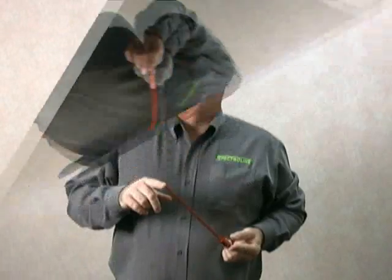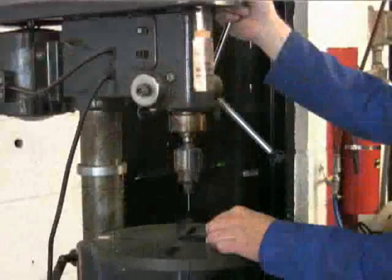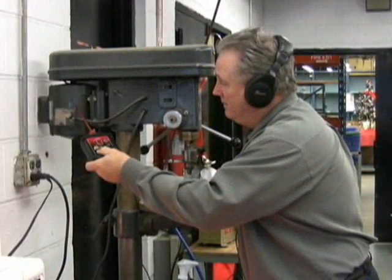At the top of the receiver is the nose piece. This is where the Marksman gathers ultrasonic sound. The nose piece also serves as a holding fixture for the air and contact probes. The air probe is hollow and nothing more than an extension of the nose piece — it's used when you're looking to isolate a problem among several suspect areas. The contact probe is solid and is used to check parts like gears and bearings that are enclosed in some type of metal case or housing. Sound waves travel great through materials like metal, so just touch the tip of the contact probe to any part of a case or housing and listen for signs of wear or damage.